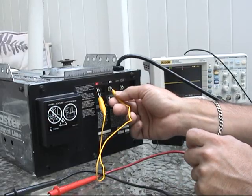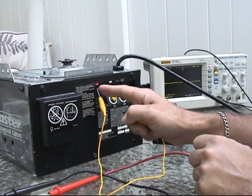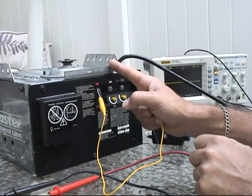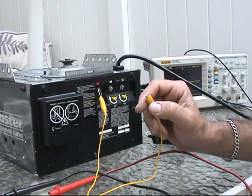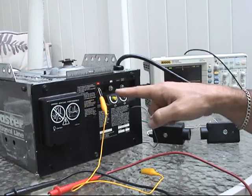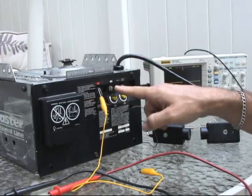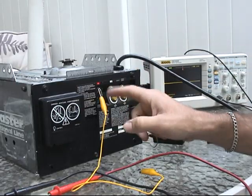If I press and hold it to keep it closed, it will close. What I did is I hold it between one and two — short circuit — and force the door to close down, no matter what. Now if I want to open the door, I just press the button and the door opens. The door opens no matter what the position of the sensor is. In order to close, the sensor has to be on. If the sensors are not on, the door will only close if you hold the short circuit, or hold the door close button between one and two.